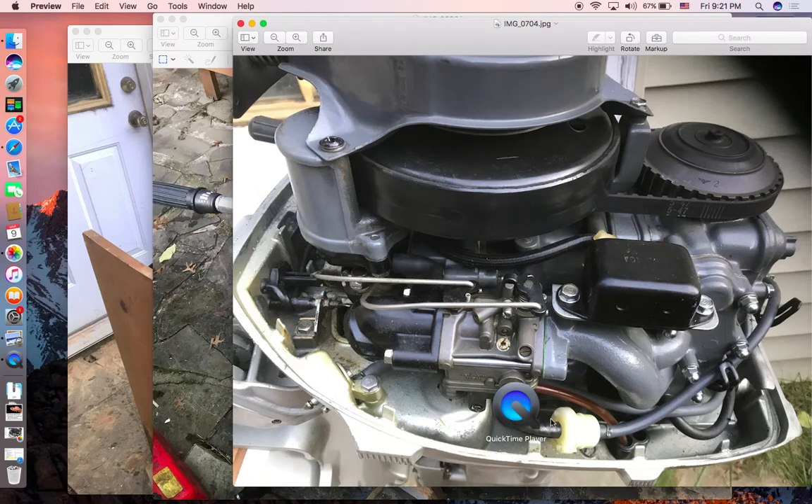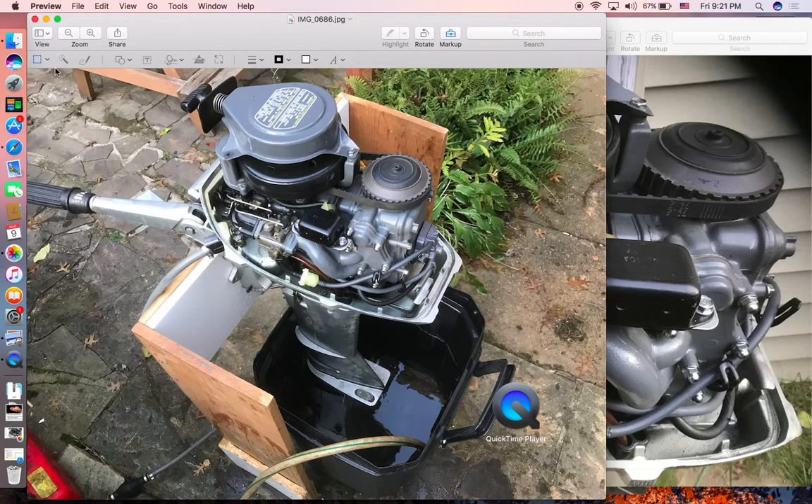This is what the outboard looks like. This is the outboard and this is the tiller handle. The way you control the outboard speed - to make the boat motor go faster - is you turn this tiller handle knob counterclockwise. The mechanic of it is: by turning counterclockwise, there is a cable underneath this aluminum tiller handle that links to a post right here, and that is hooked to this aluminum rod, which is hooked to the arm that controls the speed - that controls how much air feeds into the carburetor.